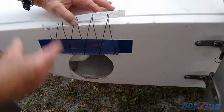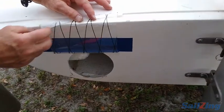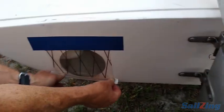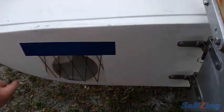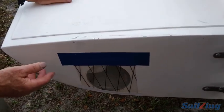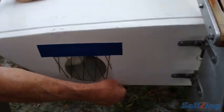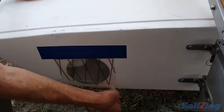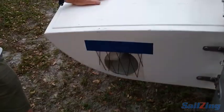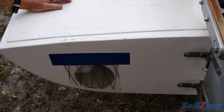I have pads on both ends of the boom. I only did this on one side because you only need to store the boom once — and I get tired of it. You can actually put the boat in the water without anything on the transom hole at all. Without the plastic you'd probably get a couple inches of water in the boat, but once you're sailing it's out of the water. If you do swamp the boat, you tear the tape off completely so it won't reseal, and then when you stop — which happens a lot — the water just flows right out.